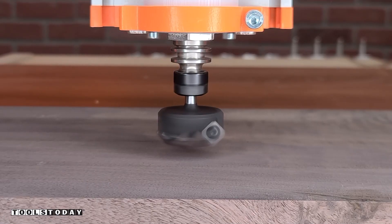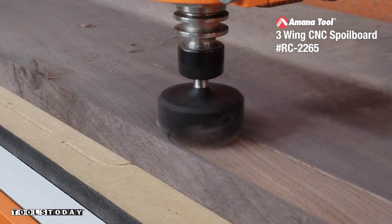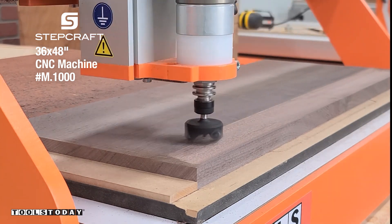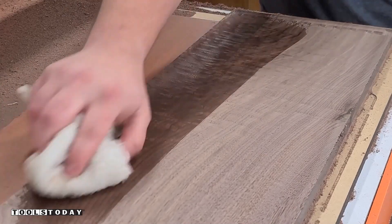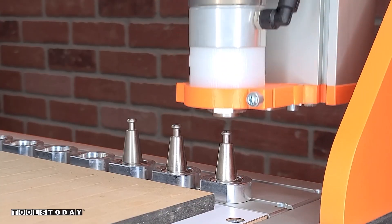We're going to start off by flattening this piece of wood. If you can believe it, this is a piece of walnut that I salvaged from a burn pile at a sawmill. There was a much bigger piece attached to this, but I was able to get this little piece out of it and it'll work perfectly for this dog bowl stand. Using the Stepcraft M1000 with the vacuum table, we're able to get this flattened off using the RC-2265 three-wing insert carbide flattening bit. It did a great job and you can see that beautiful grain there on the wood.